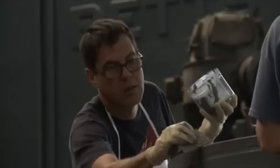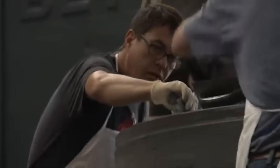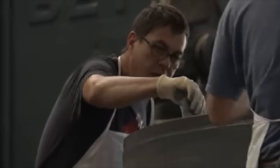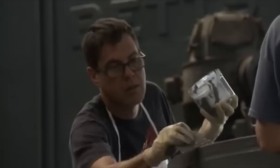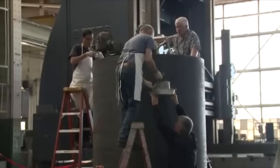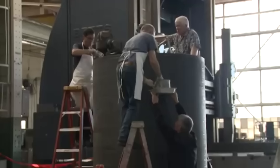If I was going to bond these two parts together, I would want this done in a clean room environment with a temperature and humidity controlled workshop. I'd want nitrile gloves, a full Tyvek suit to prevent any human hair, dust, humidity, or grease getting onto the parts to be bonded. It's pretty wild to see an assembly of this magnitude and cost being assembled by a couple of guys in no better than aprons with little tiny gloves on, or in fact no gloves at all.